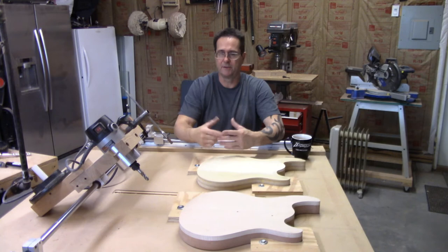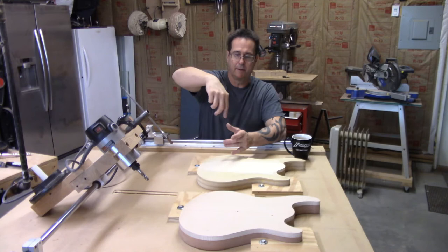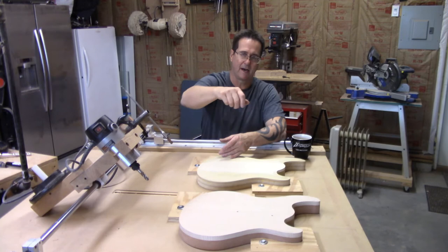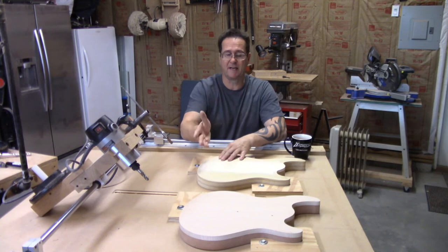The first thing I'm going to do is pull this body back out and put my tapered template on it. It's a template that sits right on the body — a little narrower than the outline of the body. I'm going to route an edge on it, kind of like doing binding, and route down to the thickness I want for the top where it's going to still expose this maple top as a false binding. Once that's done, I'll put it back in the machine and carve it out.